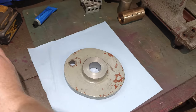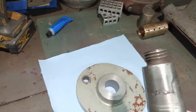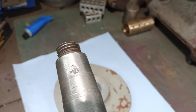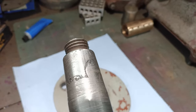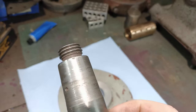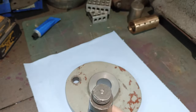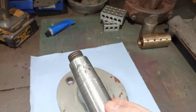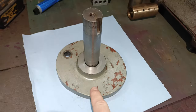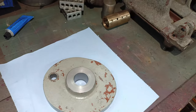One of the problems we had was the original drive shaft — this goes in there. You can see that the surface of this is terrible. It looks like it's been welded and filled in in places, and the nut that secured it at the end wasn't tightened up correctly. As a result, that caused the ball that it sat in to be all marred and damaged inside.